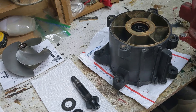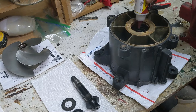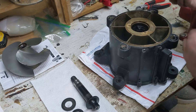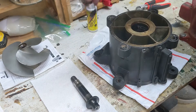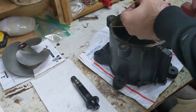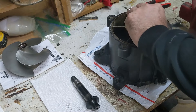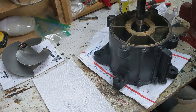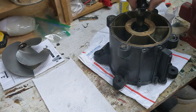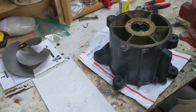Now we're going to put the shaft back in the pump. We're going to put a little bit of sealant down in here and around that. Then the thrust washer goes on — this is the thrust bearing. Put oil on both sides of this. Then I'm going to slip this down in here very carefully, and hopefully we won't need any special tools. There we go — went right through. The shaft is in.